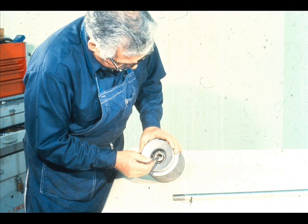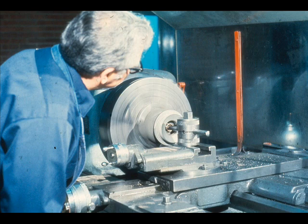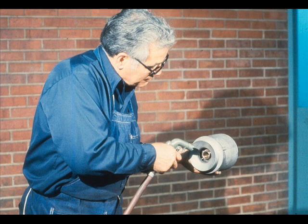After the bearing is seated in its fit, the workman measures the inside diameter, then compares it to the OD of the shaft fit. Comparing the two measurements will give you the amount of clearance fit. If it is unsatisfactory, it may be necessary to machine the bearing on a lathe. If machining is required, make certain that you clean all of the shavings out of the bearing and bowl after you have finished, as a stray shaving could ruin the bearing and shaft after the bowl is reinstalled on the pump.